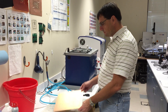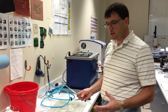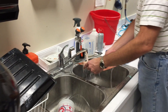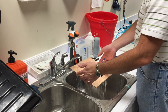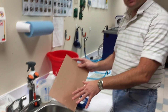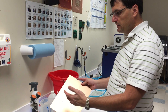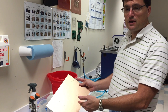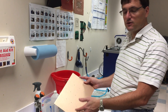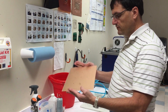Your board is off the machine and now ready for plating. The first thing we're going to do is wash off any debris left from drilling. We'll use the sink water and rinse it off — make sure there's no dust and debris left on the board. This is the last time we'll use tap water on the board before we start plating. Any time tap water comes in contact with the later bath, especially number three, it will destroy the chemical in there — it will actually bind with the activated charcoal site and disable it. So it's very important we don't use sink water after this point.